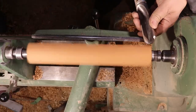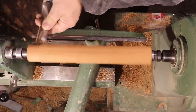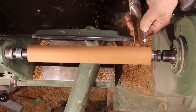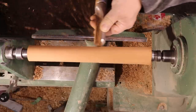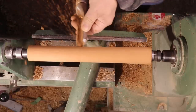So it's just a piece of inch-and-a-half mahogany. All I did was turn the profile of the leaves in the center of this, and I left the headstock end with some flat surface on it. I used that flat surface to lay on the bed of my bandsaw so I could split the profile piece right up the center, which would leave me a leaf for each side.